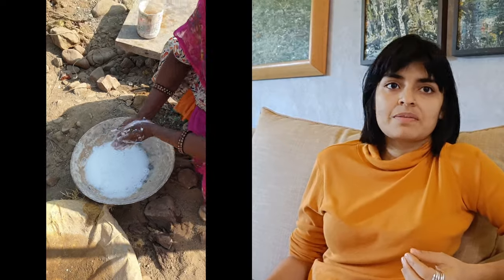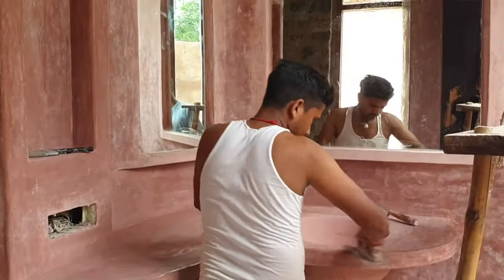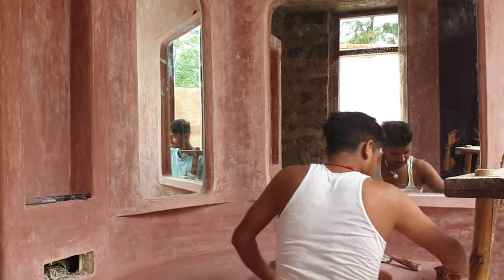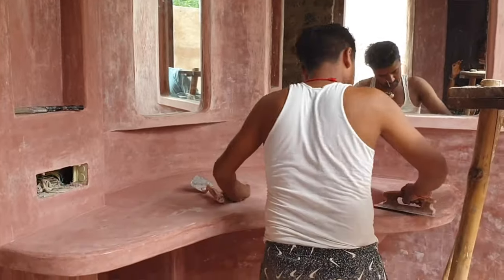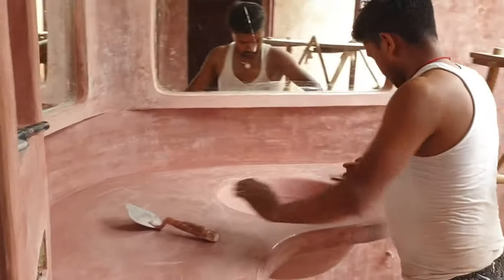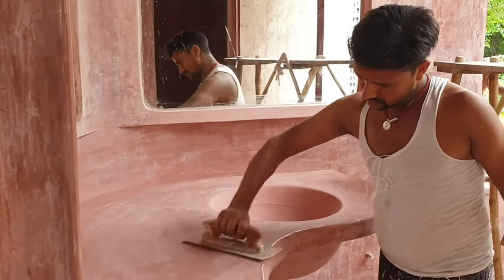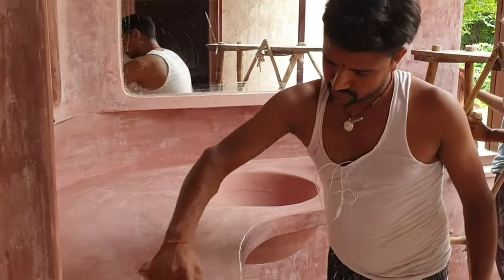In our practice we use soap, which is a very simple way to deliver stearic acid to your application. Polishing is actually a process of burnishing where you're using a very basic trowel — a hand tool — and the pressure of the palm to physically get the soap to react with the lime layer underneath. You layer lime, then apply soap on top, and use the pressure of the palm to bring the soap to react with the lime and create calcium stearate.